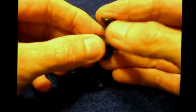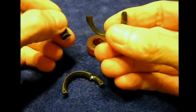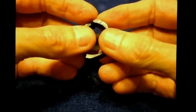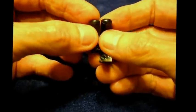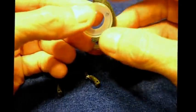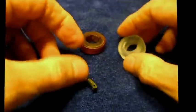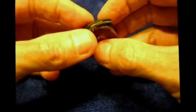Here's an abortive effort to make a friction shoe. I used epoxy and put black dye in it, but it didn't work at all against the plastic. It was quite a trick because the fit has to be exactly right. Otherwise, this didn't make any noise or any sound at all, but neither would the amber, because over the years it gets contaminated with oil, the slightest bit of oil, and it'll never play again.